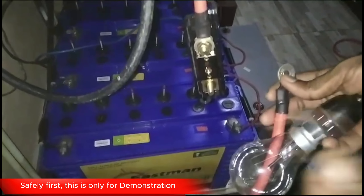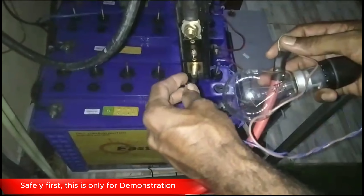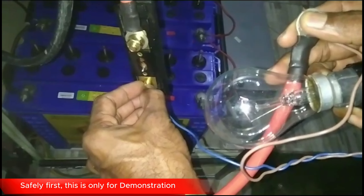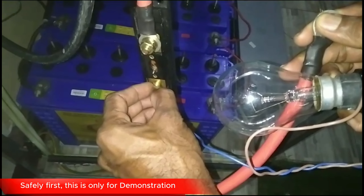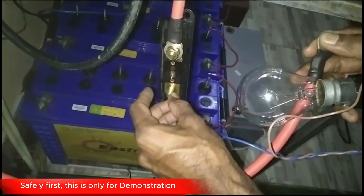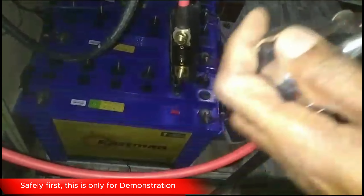As you can see, any of the wires connected to the bulb can be used to connect between the battery and the inverter. The faint glow in the filament can be seen during the first few seconds and then it fades off, but we hold the wires for a few more seconds to make sure the capacitors are fully charged. Then disconnect and reconnect the wire to make sure that the pre-charging is complete.